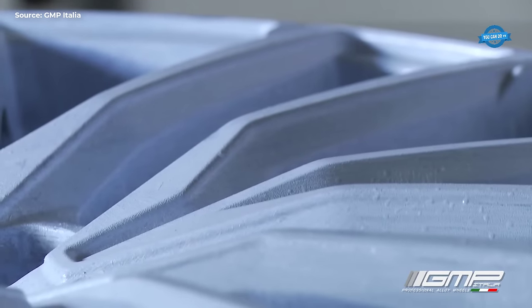After the ceramic shell mold is formed, the wax patterns and sprue are removed through either steam autoclaving or flash fire de-waxing. The melted wax is drained out, leaving behind a hollow ceramic shell ready for casting. The ceramic shell molds are then reheated to further strengthen them and prepare them for the thermal stress of casting. Meanwhile, the metal to be cast is melted and checked for proper chemistry to ensure the desired material properties.